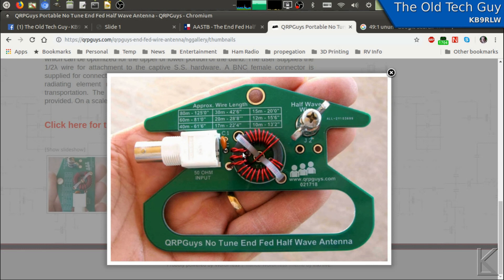They've actually got three turns on the primary and about 20 turns on the secondary on a smaller core. So I think that's about the same ratio — it's 49-to-1. They just have more turns on the smaller core, but it's still the same thing, with a capacitor across the primary.